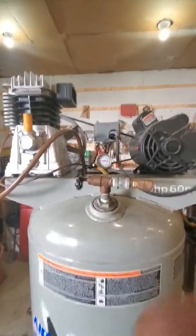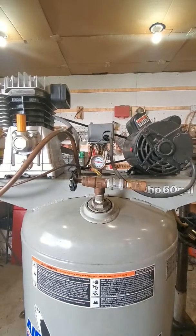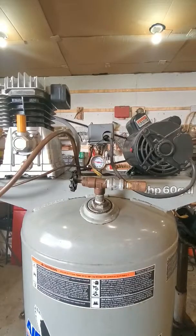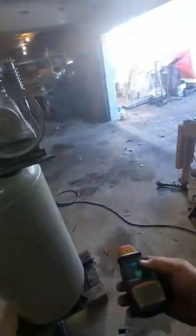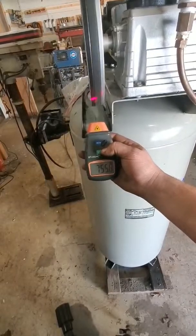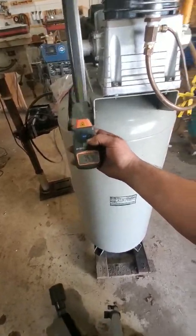I need a more rigid stand for my phone. I'll get it plugged in and grab the tachometer and do some calculations. The motor is spinning at 3,550 RPM and the pump is at 750 RPM. This pump should be running around 1,200 RPM, so I can speed this up quite a bit.